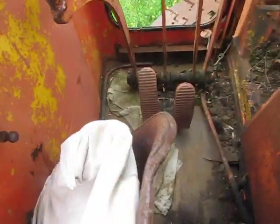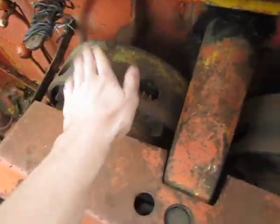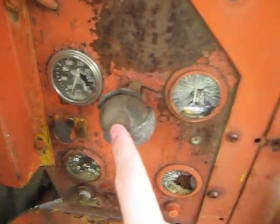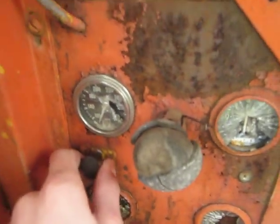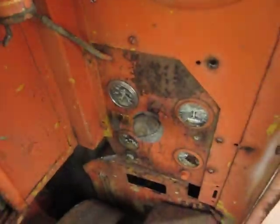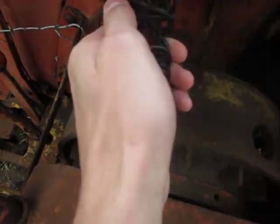Here's your back door on the unit crane. When you come back here you can see you're fitted out with your two clutches here to operate it. Here's your control panel — this is your ether pre-heater injector, your starter which is right here, and this is the emergency stop. This is where you put the ether in and pump it down in the engine to preheat it. This right here is the engine's throttle — it's got a couple different settings.